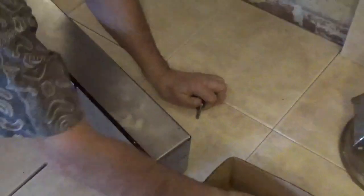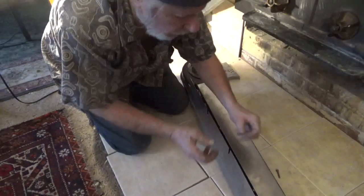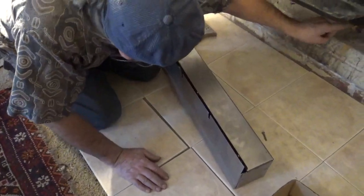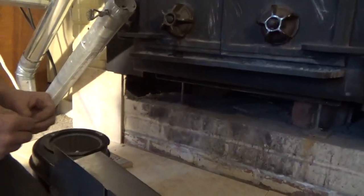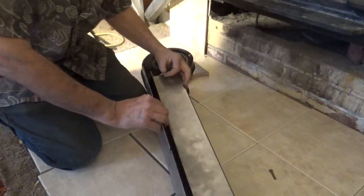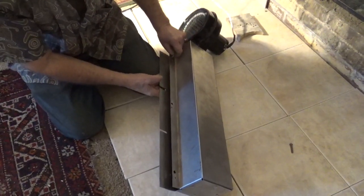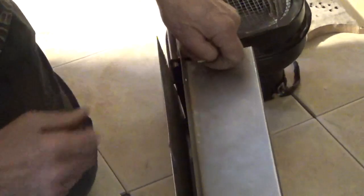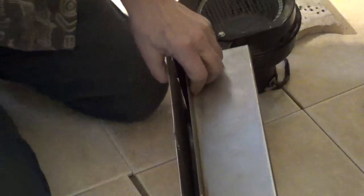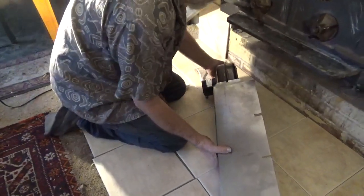Also, I use smaller sheet metal screws, and I've drilled a hole right beside my other 3 holes, so I can put a screw in and it threads in this metal and pulls this bottom lip down tight against the bottom lip. That way you don't have any vibration going on. But I'm just going to stick it in there the way it is right now.